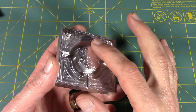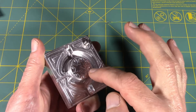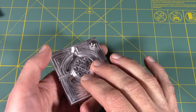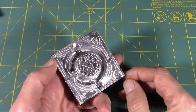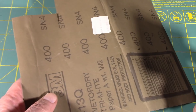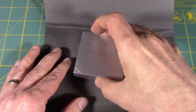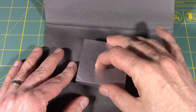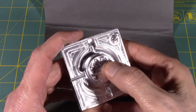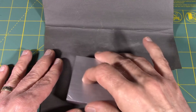Right now there's a tiny burr wherever the aluminum is near the top — there's a burr along here and along here. I want to knock that burr off because the burr is going to trap the plastic a little bit and make it harder to remove the plastic from the core. I have a piece of 400-grit sandpaper here, so I'm just going to put this down flat on top and ever so gently sand it a little bit.